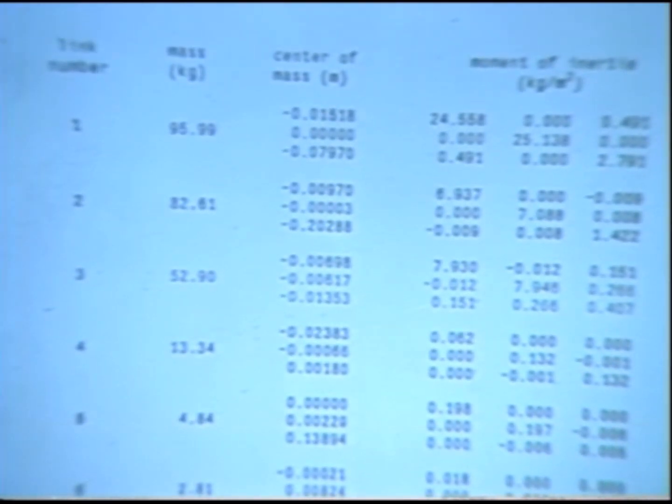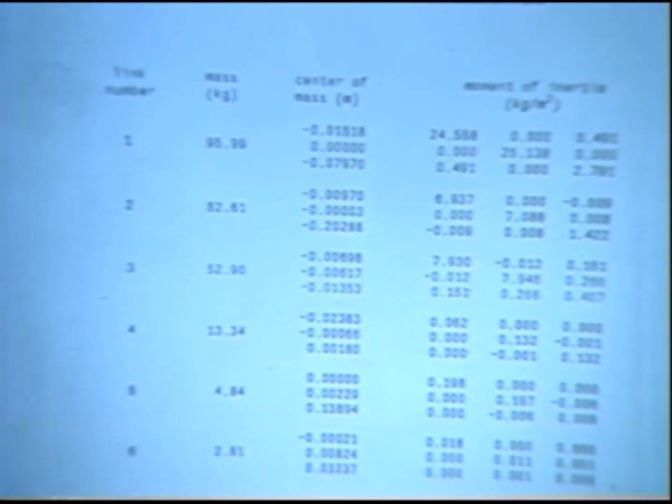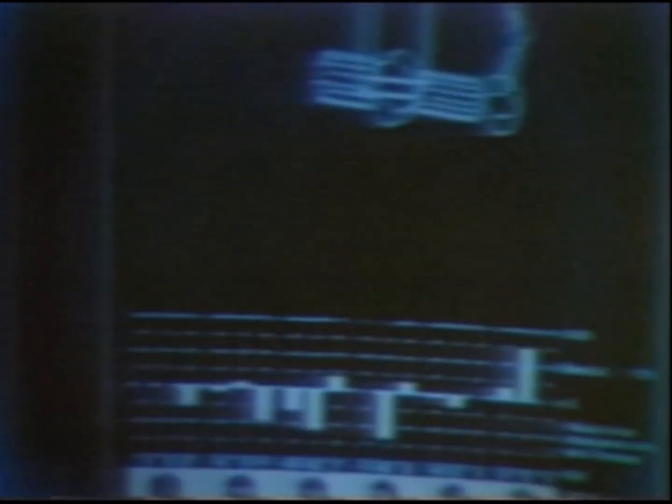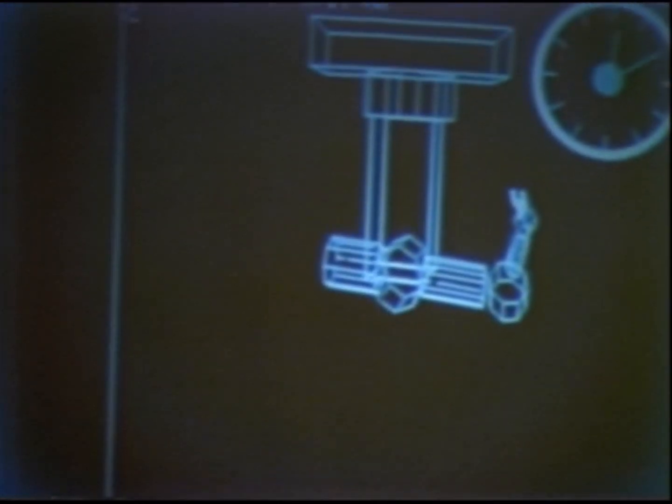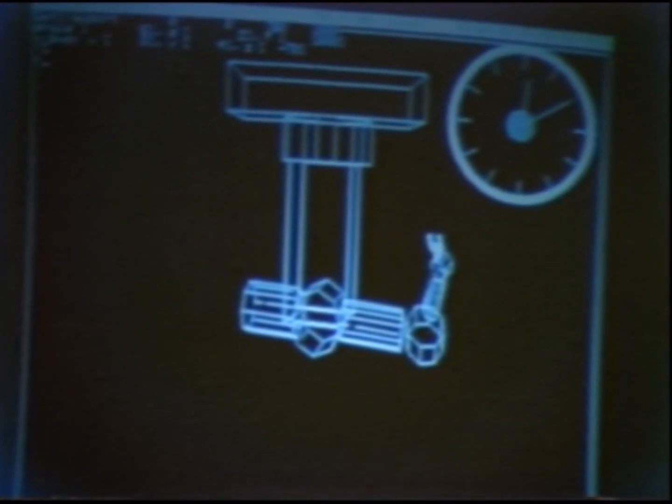We are now implementing this feed-forward compensation to the direct drive arm. We hope that will improve the response much more, and we can show you a much faster and more precise response in the future. Now we also have some simulation package of the arm dynamics. Neil Sword and Greg Fanner, supervised by Takeo Tanabe, developed this kind of simulator on a personal computer.